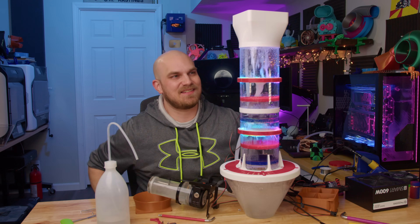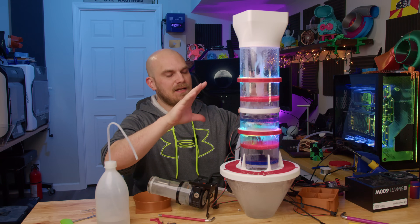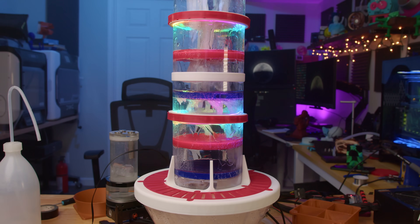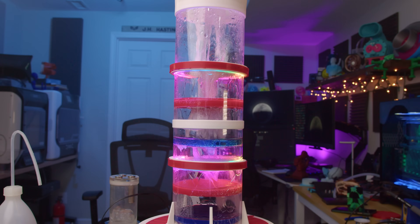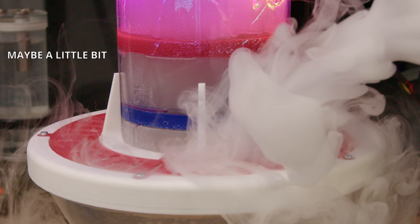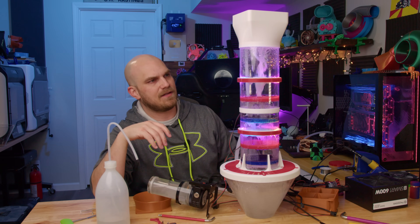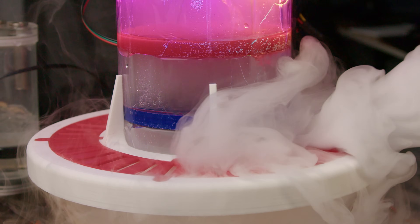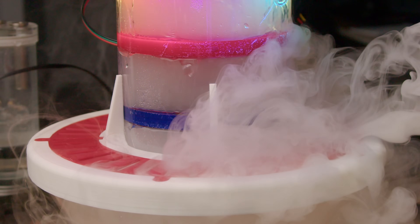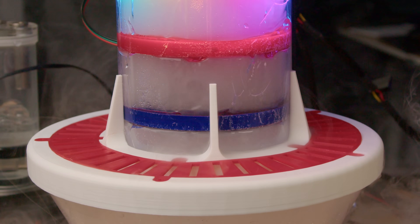It's a new day. I messed around with this offline last night — installed the showerhead-type nozzle, so the globe is gone, which is a bummer. I rearranged the fill a little bit, flipping the top fill upside down so the water is pushed towards the middle rather than all towards the outside, and that seems to work a little better. I ran a smoke test to check airflow — not much. I took the filter material out because it got wet and was suffocating the system. I reduced the water level and tested other fans including the Noctua. It might work.